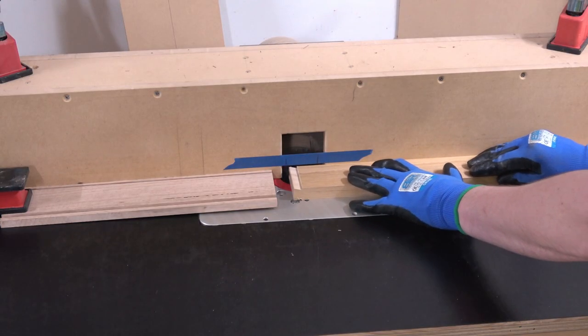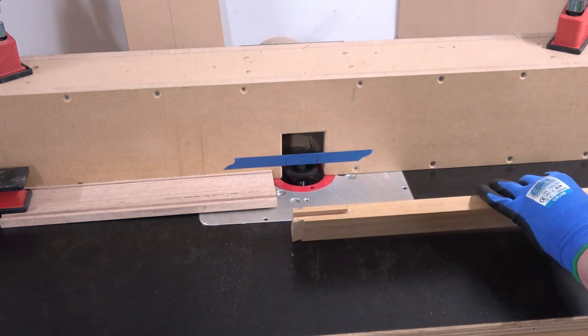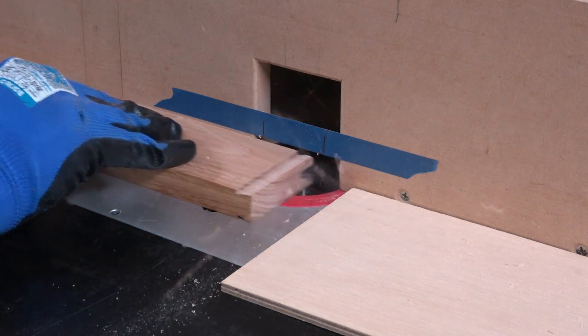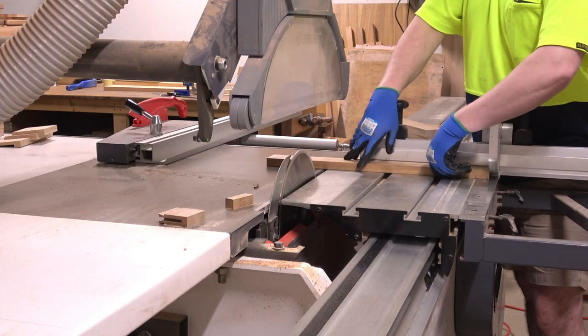These mortises, they're not overly critical. They're simply to position the draw guide rails, so I can just actually use a slot cutter and cut right into the end of it. It does make a relatively weak joint, but it's not a very structural joint to begin with, so it doesn't matter that much at all.